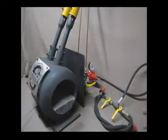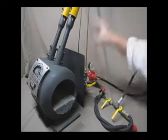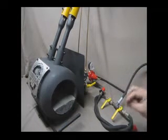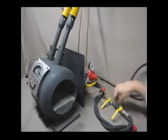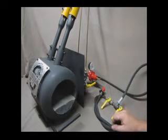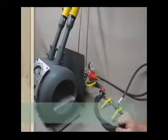You pressurize your system and then spray all the joints everywhere with the leak detector spray, including the ones at the top. And wherever you see bubbles, you would then just tighten the joints. Now, through time, these things do tend to go loose, especially if you travel with the forge. But please do regularly check your system for gas leaks.